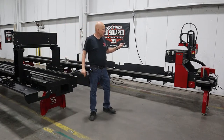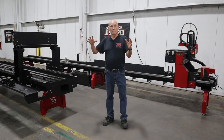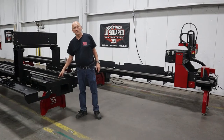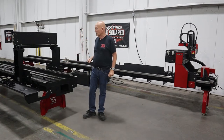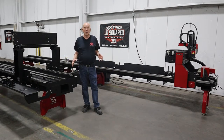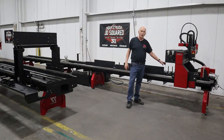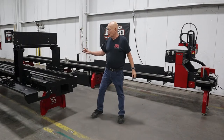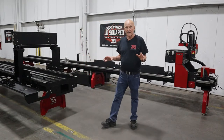We have a single tool rail in the XR6 — that's all we needed and it's plenty strong enough. On the XR12, considering we're going to be loading much heavier pieces of metal, we've gone to a dual rail tooling system. That will allow us to put much wider tool systems in it for more stability. The frame also got wider and a lot stronger because of the material weight. Whereas we're using a 3-inch, quarter-inch wall square tubing backbone on the XR6 frame, on this machine it's a 6-by-8-inch, quarter-inch wall rectangular tube for extra strength.